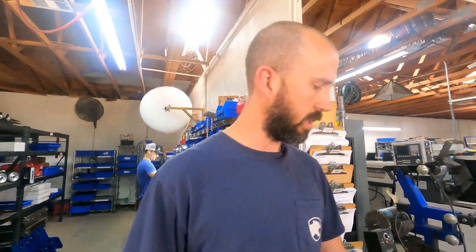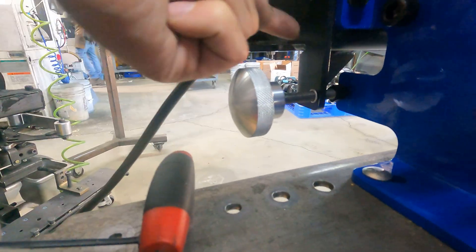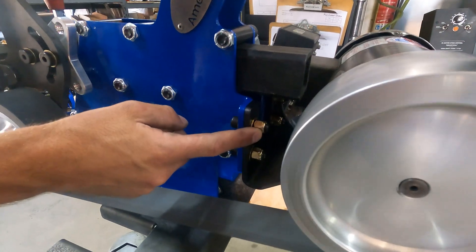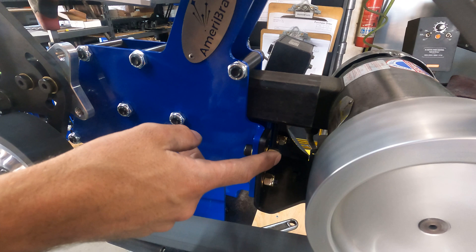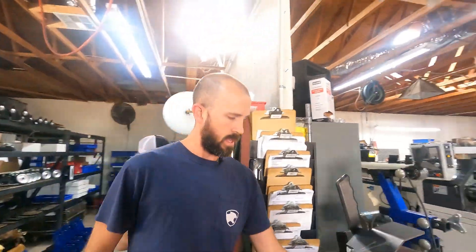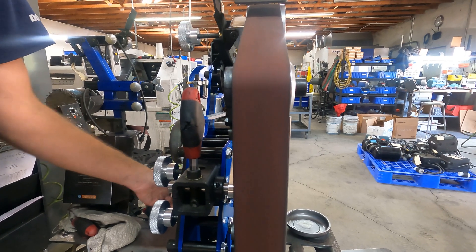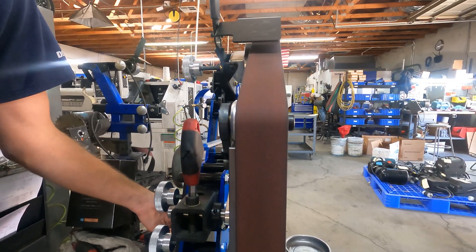The better way of adjusting the tracking is with this knob back here on the motor mount. That knob tilts your entire motor mount, so do not tighten the bolts down and lock your motor mount. These bolts are intended to be loose — the lock nuts will keep them from coming any more loose. They're minimally tightened so this black piece is free to slide on the blue piece. As I crank this tracking knob back here and tilt the motor, you'll see the belt respond nicely and predictably, and I can bring it right back to center.